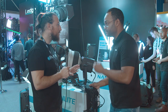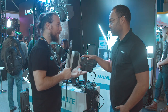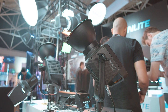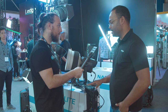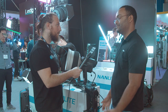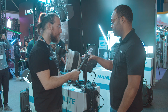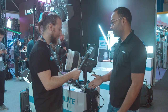Battery-wise, what are we looking at — let's say a 26-volt? You're going to use a pair of 250s or more, and you're going to get about an hour to hour and a half, depending on the type of battery you have. It's all about 26-volt at the battery manufacturers these days — those batteries are more appropriately suited for this light. There have always been 250-watt lights on the market, but to drain a battery from 100 to zero in an hour is going to kill the life of the battery — instead of a seven or eight year battery, you're looking at four or five years. The newer batteries coming out are going to be a lot more suitable, and you get a lot more life out of your battery using it on this light. A 500-watt LED can run on DC power.